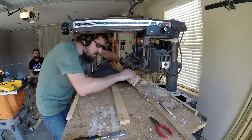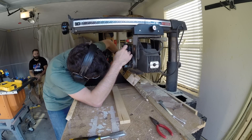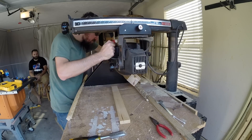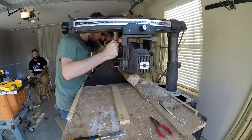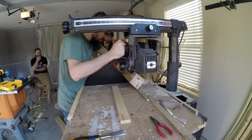The four by fours that we used for legs needed a special cut to allow for the angled braces connecting the inside edges of the skirt. We needed to cut out a 45 degree angle section that was the same depth as the angled support. To achieve this cut, I made a quick and simple jig with a couple pieces of scrap that had a 45 degree angle already in place from another project.